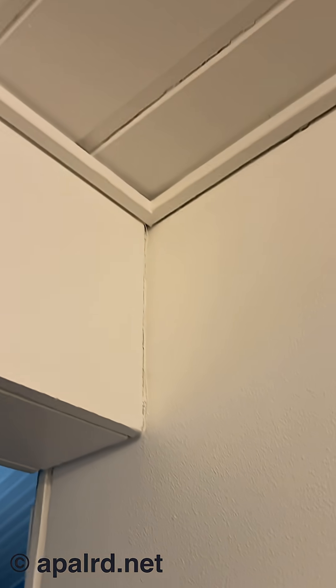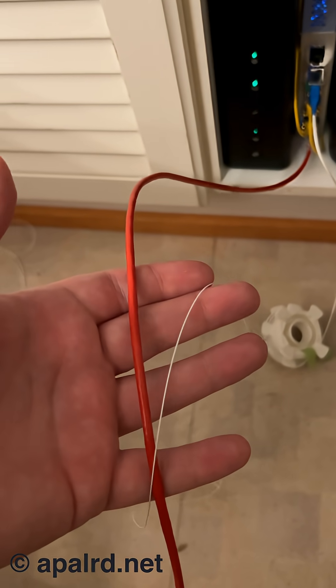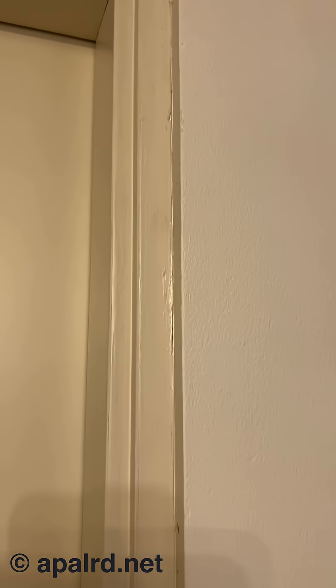With that done, I guess it's time to just show it off. As soon as you come into my house now, the fiber runs right through the middle of the room, and if it weren't hidden like this it would be very visible. If I was running traditional Cat5 — even the really small flexible stuff you can get from some online places — it would still be quite visible in this room. But the 600 micron, less than a millimeter fiber, it sits in the corner, it's glued in, and it blends right in.